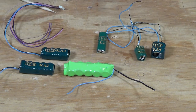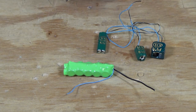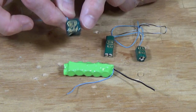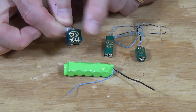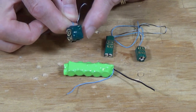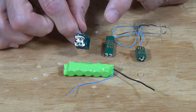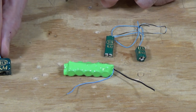Now, what's even smaller? If you need to really cram something into a small locomotive, one thing they came up with a number of years ago was the KA4. It's got four capacitors in it — one, two, three, four — and it does a very good job of keeping your locomotives from stalling on dirty track and electrically dead sections. So that's another option.